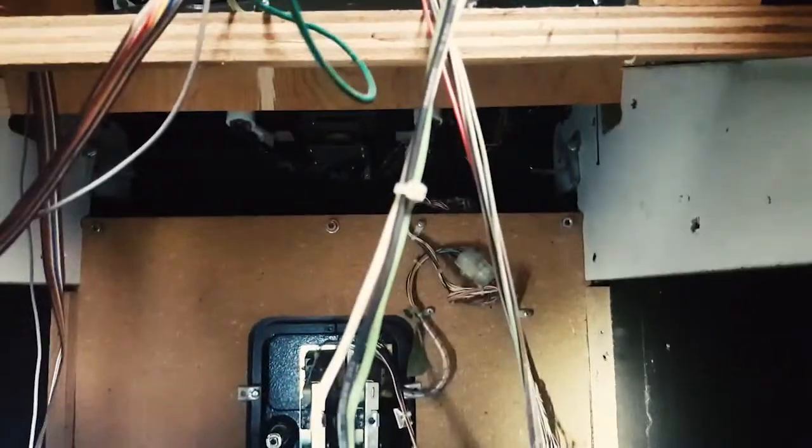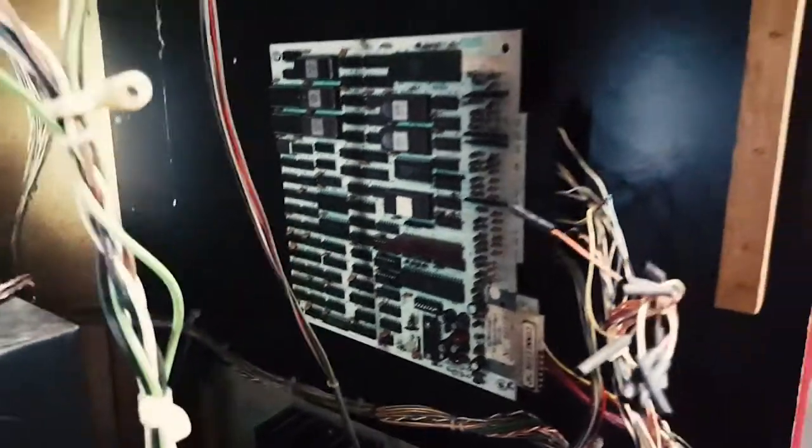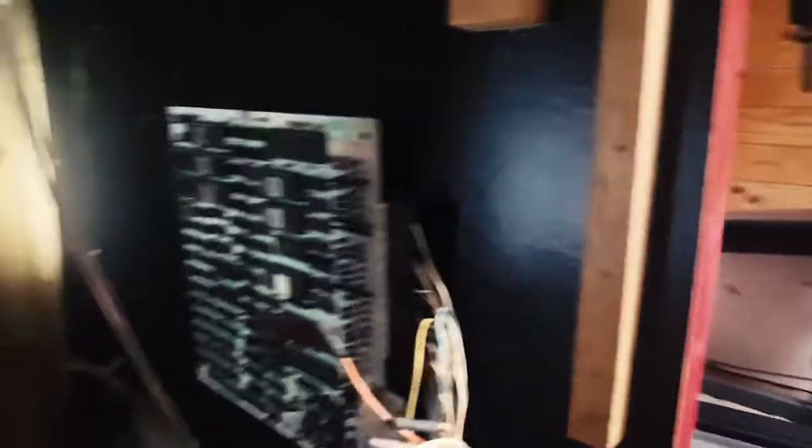Then this section goes into my Atari AR2 board — it's an amplifier, a sound amplifier essentially. This line goes up into the assembly and provides power to the 12V or 5V LED and power for the controller. These are the optical electrics, the spinner. This is Arkanoid and these need 5 volts and ground as well. From this amplifier board, power goes to the main board — this is the Arkanoid motherboard, your game and your console.